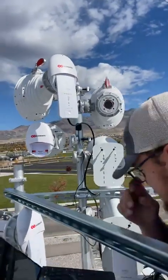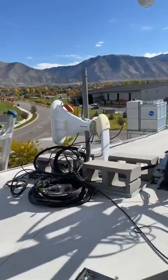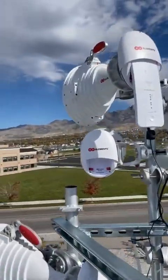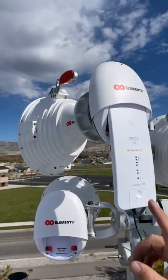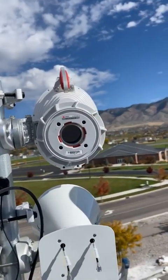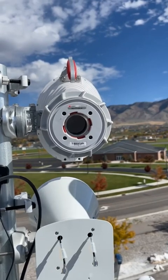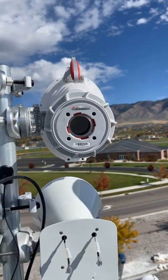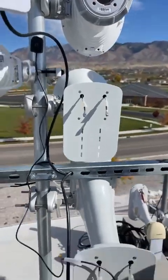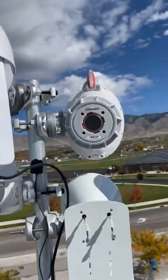It's worth noting — we just divided this up. There was previously a 90 degree horn going into that ladder, but now we've got that divided up into these six 30 degree horns. We took this one in the middle, which had the most stations, and started by aligning it properly — when they first divided it up it wasn't properly aligned. Then we tested against the RF Elements symmetrical, the ISO Horns symmetrical, and the ISO Horns asymmetrical.